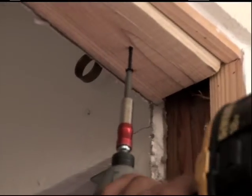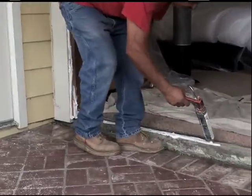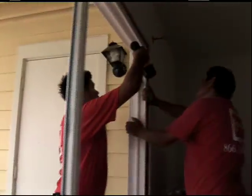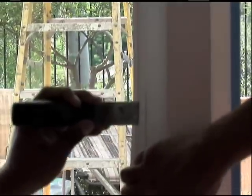At times header heights may need to be adjusted. It's very important to make sure that there's ample caulking underneath the new frame before it's installed. The frames are secured in place with three-inch screws. Next, the glass is installed into the frame. The glass is secured with snap trim, and the sliding portion of the door is installed and adjusted.